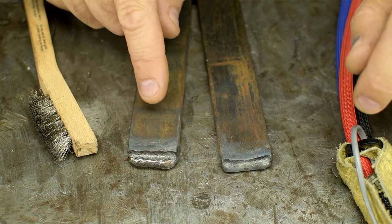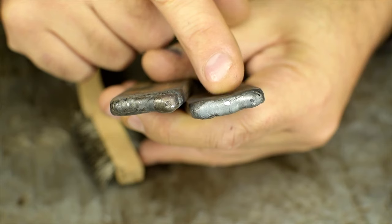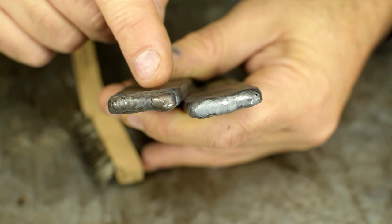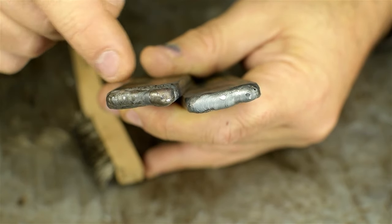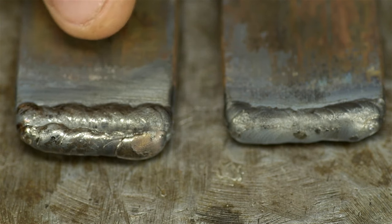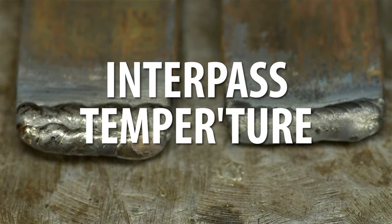And there it is — that's the tool steel, and this is the hometown classic. Not my best work, but you're looking at three beads on the mild steel and four — four and a half — on the tool steel. Depending on how hard you sink the bead, you get base metal and filler dissolving into each other. So I put an extra bead on top so we know we have pure, unadulterated tool steel. I am a little worried I may have overcooked this weld a bit — subsequent passes making it hotter and hotter. I've never been very good at waiting for welds to cool. Hopefully I didn't destroy its magic properties. If you're curious, read up on interpass temperature.